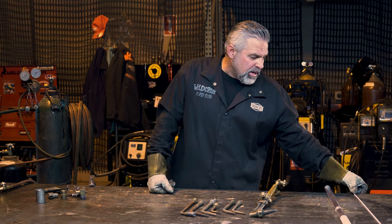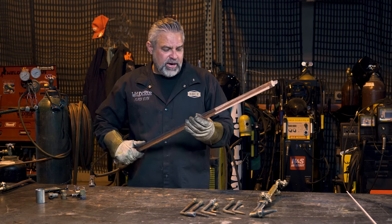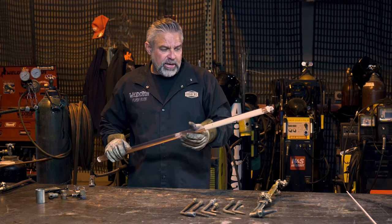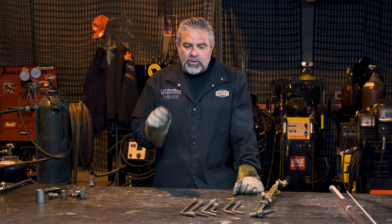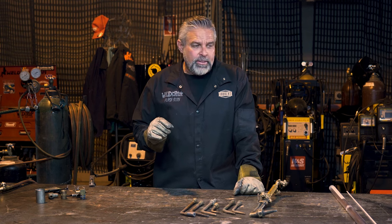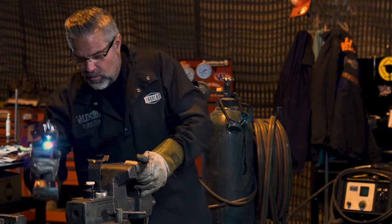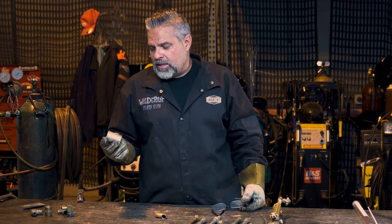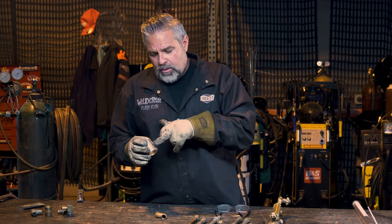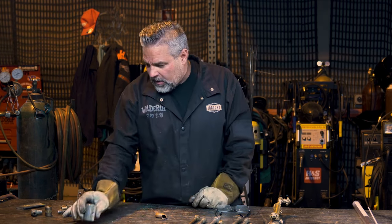With a torch and a flame you can get it really hot, then you get some brazing rod or regular steel for welding metal together. Brass is so cool because it flows and it's low heat. Once you learn how to weld it, it's not the prettiest weld but it usually always works — and that's what I love about brass. I've got a hole set up as a scenario: say you had a piece of pipe on a radiator or plumbing system with hoses hooked to it, and cutting it out would be a nightmare. Brass is a good way to repair that.